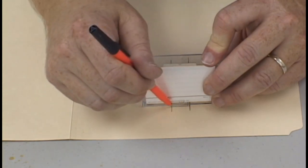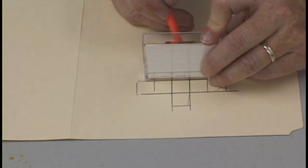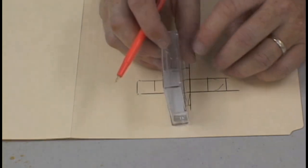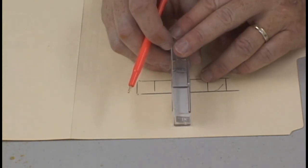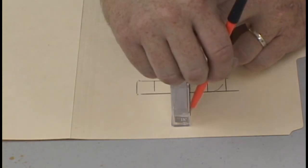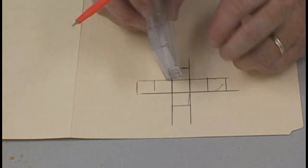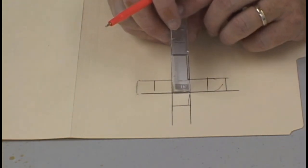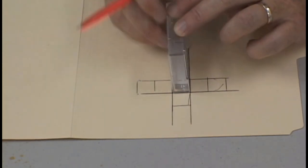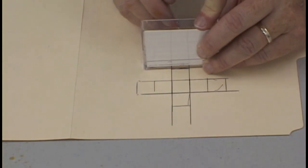Following the visual cues shown here for making your mold key, as you put together all the cross marks on your file folder paper, you will see that ultimately you've produced one of the best keying systems available. Our purpose here in establishing a parting plane on our mold is to allow us to produce a mold which will be easily removable from an object that has severe undercuts or would normally be impossible to demold out of a one-piece mold. Learning these techniques now, along with a little bit of ingenuity, will allow you to mold objects in the future that most people would consider impossible.